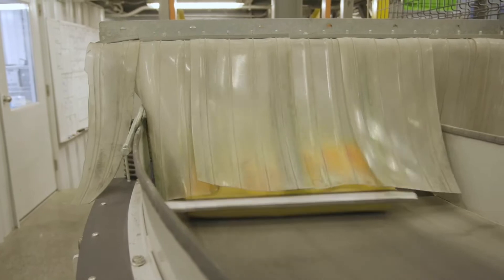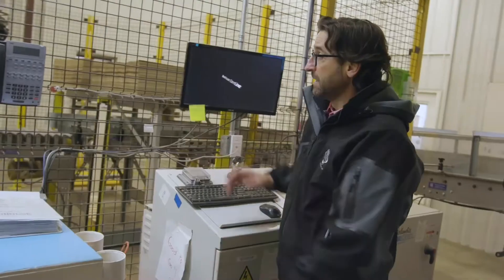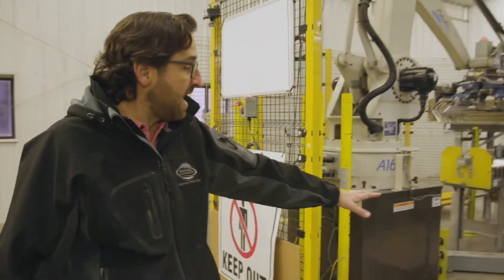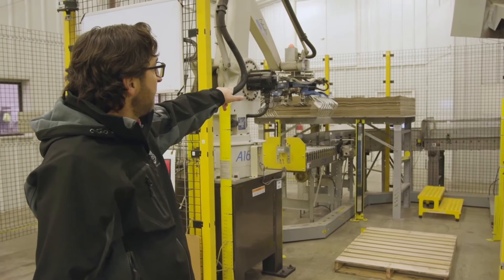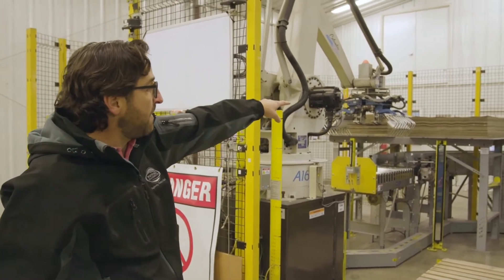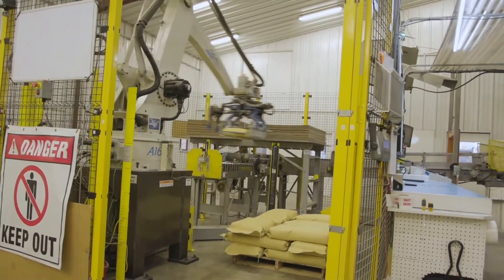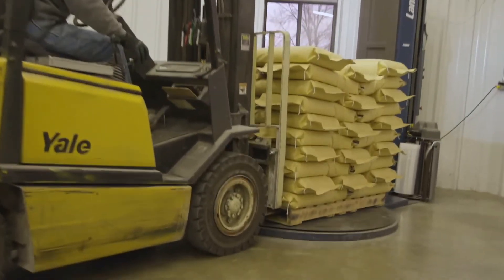From here it goes around a curved conveyor into a robot. Our robot station and bagging scale and controls are all right here. When corn comes around, it gets fed into the robot. We usually have pallets stacked here — up to three pallets at a time. The robot has two suction cups on the end and it swings, pulls cardboard from the pile, and applies it to the pallet before it starts stacking. Once it's done stacking, a fork truck comes in on the floor, breaks the light curtain, picks the pallet up, and pulls it over to wrap the finished pallet.